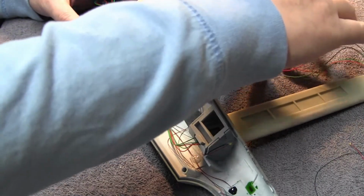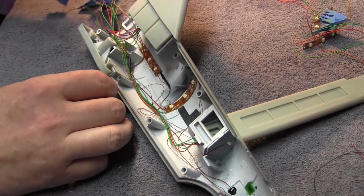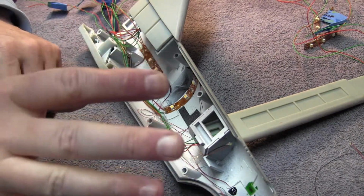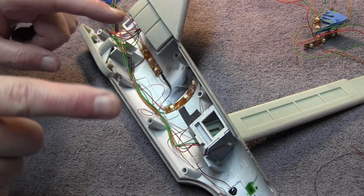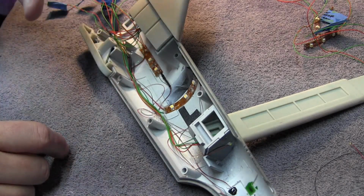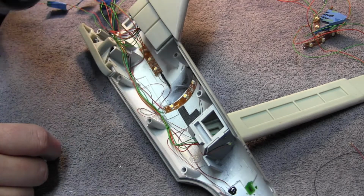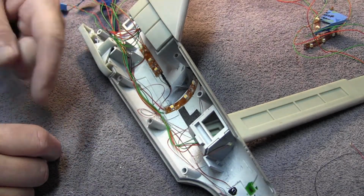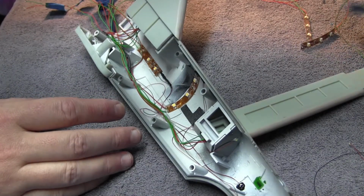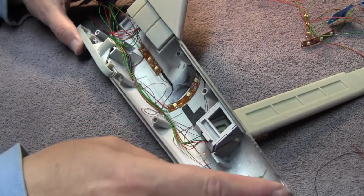Now this particular board is a newer one from Ralph at Tenna Controls. On the older ones, when you start up the kit, like on my very first one I did with Ralph's, the Bussard fans and the lights on the Bussard boards started out going real fast, and then you had to push the momentary switch to get them down. Well, with this board, the lights stay rotating the same speed all the way through, and the momentary switch controls the fan speed. So we had to go through up here and make sure we got all the wiring. I don't know if we're going to use all of it. If not, we can just pull it back through.